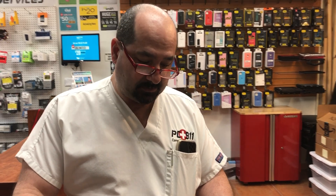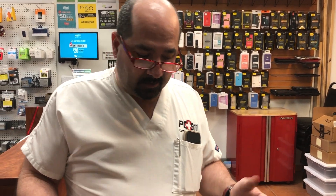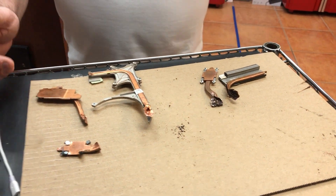So, scratching our heads, we knocked everything — eliminated all the other variables — and said it's the heat sink. We ordered another heat sink on eBay; you can't get them new. It came in and the device still got hot. So we said, no, hold on — it's not the heat sink... it is the heat sink.